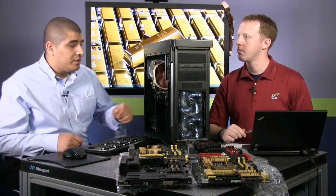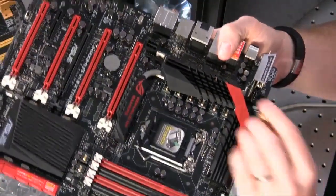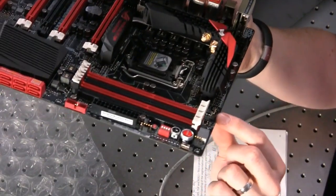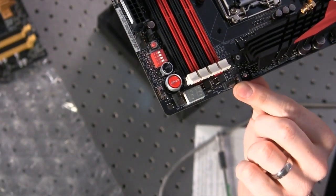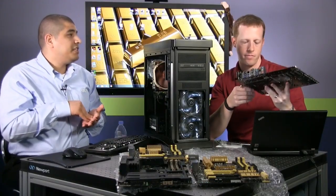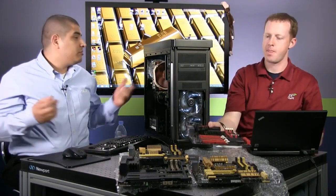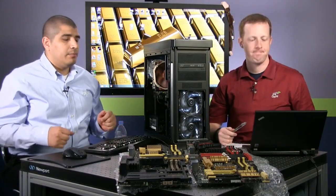Even some really cool updates for this generation, like, I don't know if you'll be able to show them, but for the CPU primary header we incorporated a new little design. It's closer right over here. Okay, so the primary CPU fan header, it's probably a little hard for you to see, but inside there's an actual depression switch, right next to the 4 pins for the fan itself. The cool thing about that little header is that it automatically senses whether you've inserted a 3-pin or DC-based fan or a 4-pin PWM-based fan, because of course they get tuned and calibrated differently. Gotcha. So the user wouldn't even have to make that adjustment. It's a small attention to detail, outside of the fact that every single one of the headers is fully controllable. And that's on every single one of these boards.